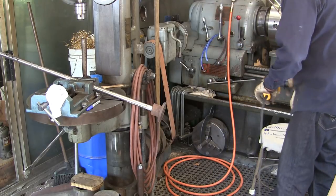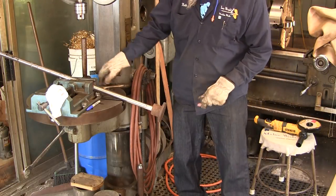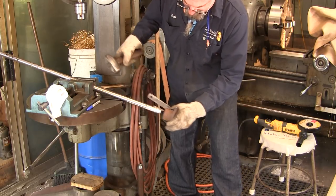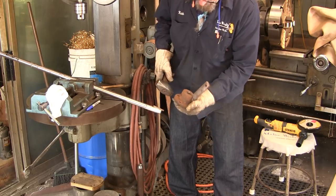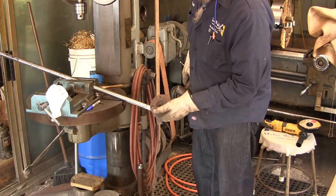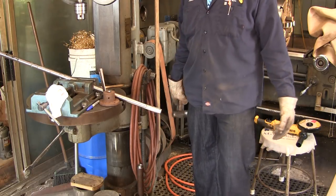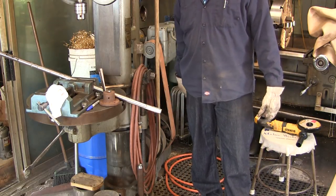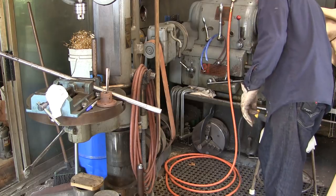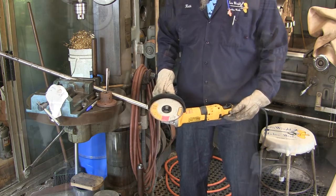Okay, we're down on top of that key. Where's our wedges? Okay, I had them in the other room. Anyway, we put in a wedge and it cracks that surface and then you're able to go ahead and slide this right off of there. Protects the shaft. No harm. And you save yourself the big dollar, sacrifice the small dollar, and didn't use a whole disc, still ready to go for more.